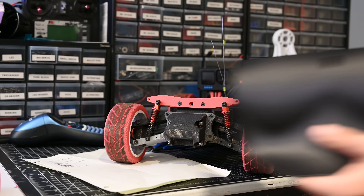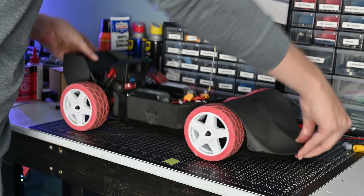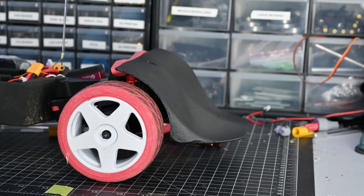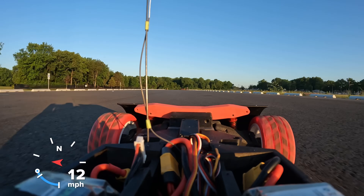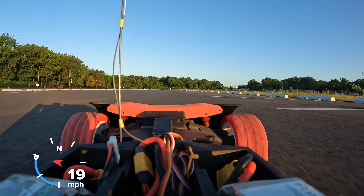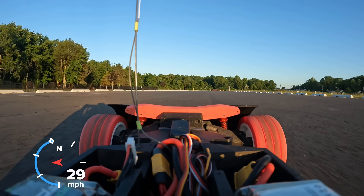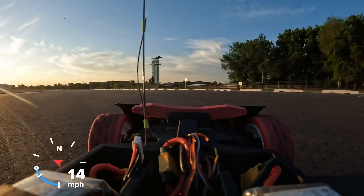Just for now I wanted to try some sort of low-effort front-end aerodynamics. So I designed this shovel-looking front scoop. Although it does look a little ridiculous, it should hopefully guide the air up over the car and then create a downforce which pushes the front tires into the ground. I went out to test this car one last time, and it definitely felt a little more responsive at high speeds. However, once again, as it got towards the 50 mile per hour mark, it gets unstable and spins out.